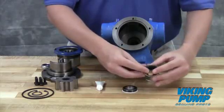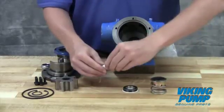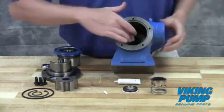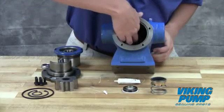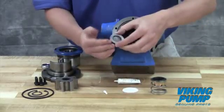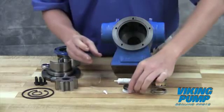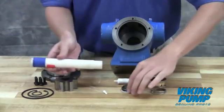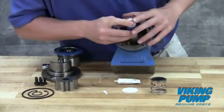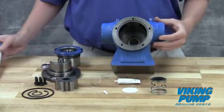Clean the rotor hub and casing bore, making sure both are free of dirt or grit. Special care should be taken when handling the mechanical seal. Do not touch the sealing faces, and be sure to place them face up on the bench to prevent scratching of these highly polished surfaces. Using the provided lubricant or other compatible seal lube, coat the seal bore and stationary seat OD. Press the seal seat into the bore using only your thumbs, touching only the outermost edge of the seat. Note that the wedge type seal includes a small anti-rotation pin which must be lined up with its hole prior to pressing in the seal face.